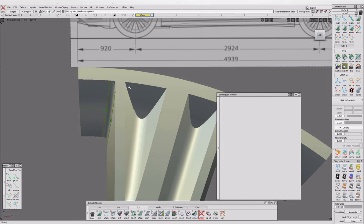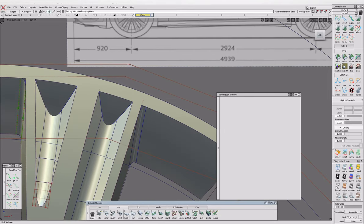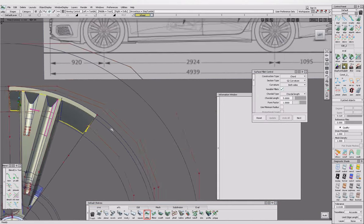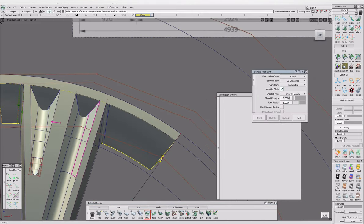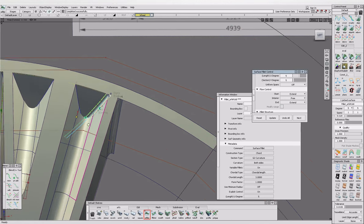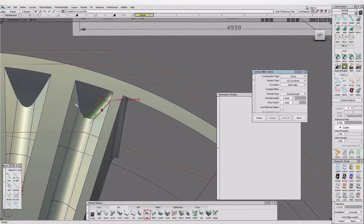And then we could do the radiuses in here as well. I just feel like it's going to be a bit annoying. We'll have to do a ball corner in here. 1, 2. We do it a bit smaller in there. 3. Make sure it's set to extend. Edge line it there. And we'll do it a bit bigger. 5mm seems fine.